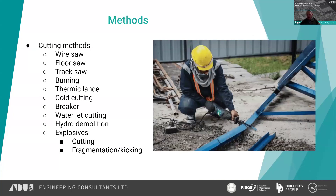Cold cutting — that might be reciprocating saws or other handheld saws. The blade technology has come on a long way now, and we've worked on a number of large schemes — not necessarily bridges but things like gas holders — where you're not allowed to do any hot cutting on site because of the potential for fires. With the modern tools and modern blades you can rip through steel very quickly cold cutting. So it's not one to be instantly discounted; it can be quite a powerful tool.